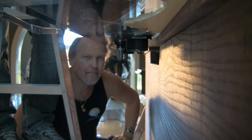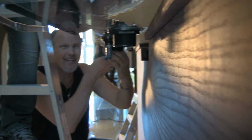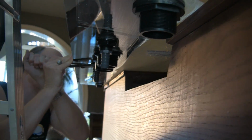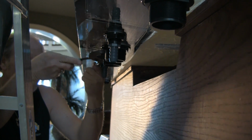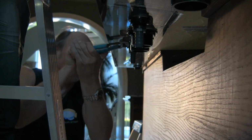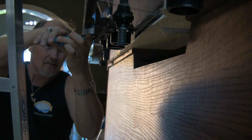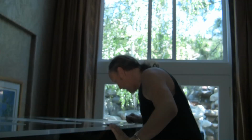One of the issues a lot of people have is how tight to tighten the bulkheads. I'm going to say just slightly more than snug, because you can actually over tighten a bulkhead, or snap it. And with the back end of the tank hanging off the back side of the stand, now is the time to tighten those fittings, as opposed to trying to tighten them through the holes that were cut through the top of the stand.